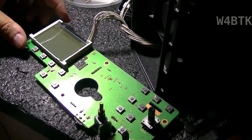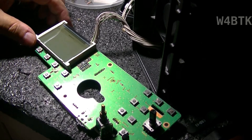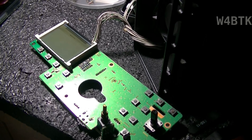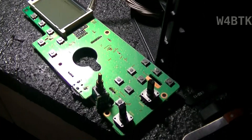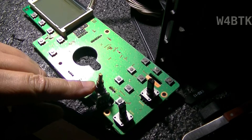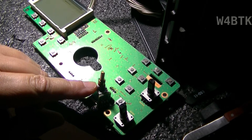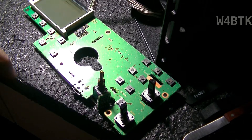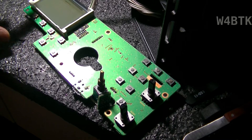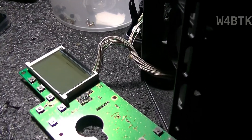And here is the display. The two screws on the back are removed, so the display will come off easily. This is what it looks like after it's removed from the radio. I removed the encoder from the front. The VFO remains on the front of the radio, so there's no removal of VFO. Let me go ahead and start working on the screen.